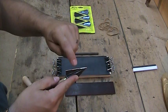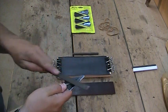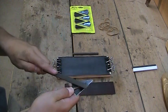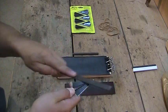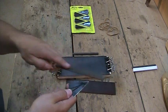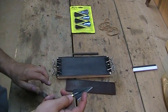When I do this side, I reach over and feel — going this way it's smooth, going this way it picks at my skin. I want to feel that burr. When I have it on every spot of that blade, I know I've worked this edge that direction. Then I come over to this side and work that edge the same way, getting that burr to go back over towards the other direction, just going back and forth. You can also go individual strokes — whatever works best for you. With a file I find no difference going back and forth because this is just shaping the edge, not fine-tuning. I go until I feel that burr on each side, then take a few very light strokes to fine-tune the edge. Now the file part is done.